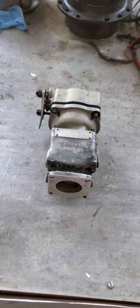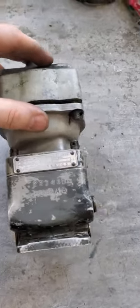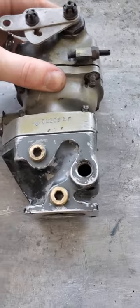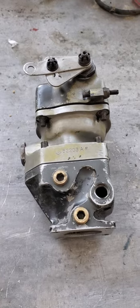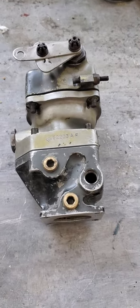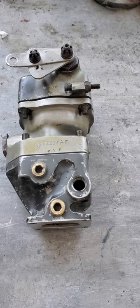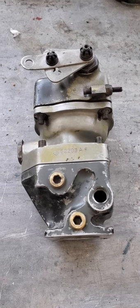We are back. Today we're going to be talking about the propeller governor. This is a Hamilton Standard 1-Alpha-4-Golf-5. This particular governor is used with counterweight type propellers. Remember that the Jacobs used on the UC-78 used one of three types of propellers: a fixed pitch wooden propeller, a two-position ground adjustable, and the constant speed propeller that used counterweights. This particular governor is used in the last of those options — the counterweight style propeller that was constant speed as well.